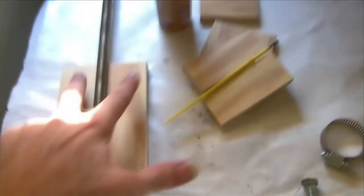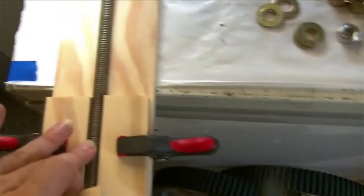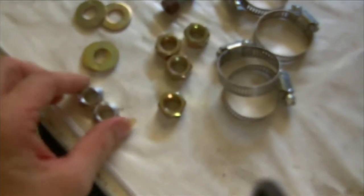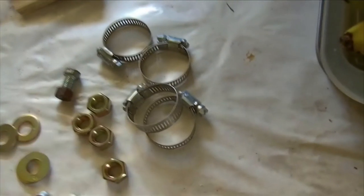This shaft is going to go through. I'm going to take these two pieces of wood, put them here, and glue those as the guide. When I'm all done putting these two pieces on this end as well and gluing them in, I'm going to put these two as caps over top — in a manner similar to this — to keep this axle from coming out of its groove. Then I'm going to put the nuts. These are the end nuts, the silver ones with the rounded end. These are my flat nuts; I'm going to put these on here as spacers. I'm going to put washers against that, then put the end nut on. The wheel is going to go between the washers.